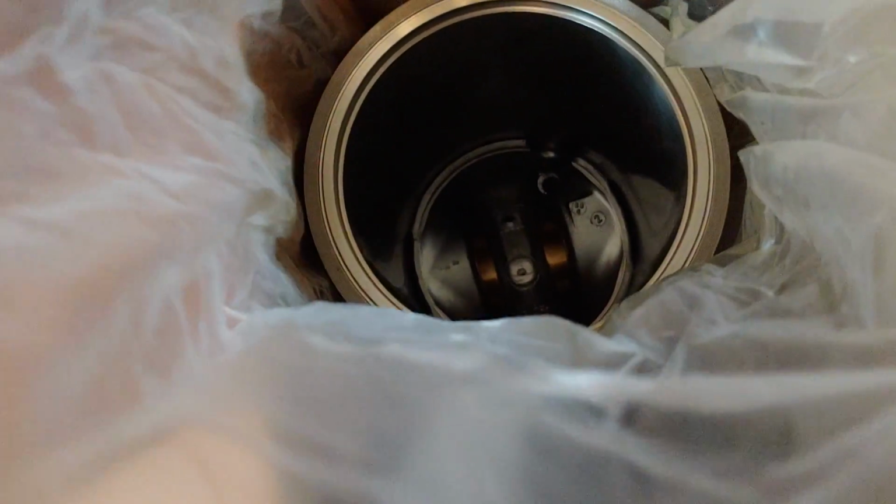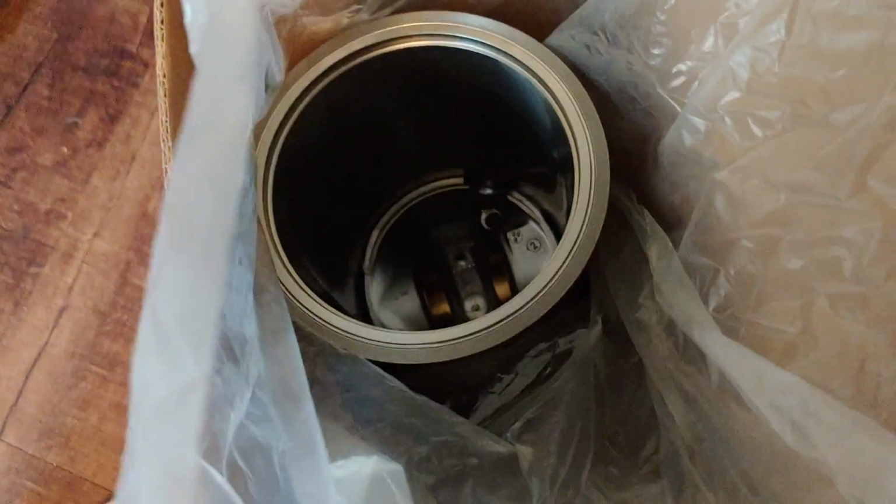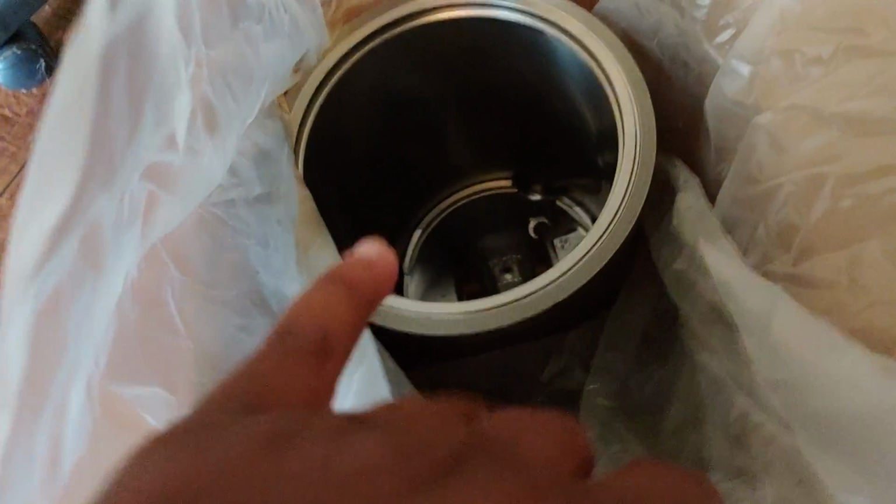So you got the piston down off in now. You got your sleeves and liners right here on the outside. It's a big component now. See if I can pick it up. Very heavy, very heavy and big. It's a lot of weight right there, boy. It's a lot of weight. So you got those components. And that's all it is to an in-frame kit.